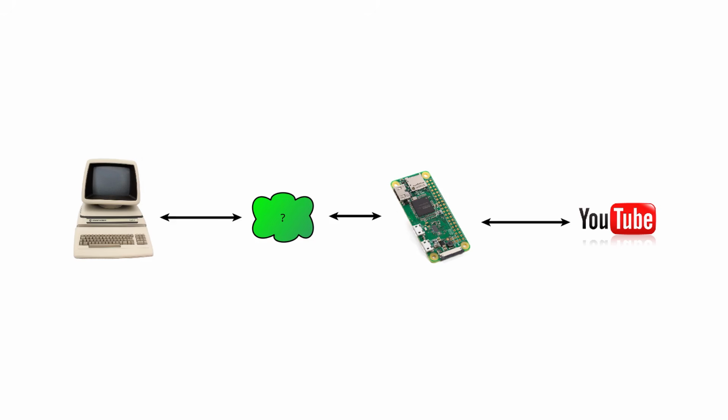To know how fast, we'll need to look at the receiving end, that is, the display of the Pet. The Pet screen is 80 characters wide and 25 characters high. That gives us 2000 characters per screen, where each character is described by 1 byte. Since we want to display 30 frames per second, we get 60 kilobytes per second to display on screen.